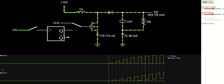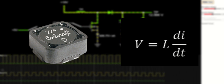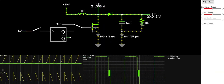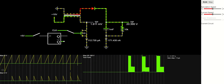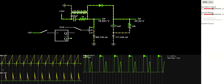This way the magnetic element is uncoupled from the capacitor — or so it may seem. On startup, the inductor current quickly jumps to a very high value, bringing us back to square one. The rate of current rise or fall through the inductor is proportional to the voltage across it. When the capacitor is uncharged, this voltage is basically a diode drop, leading to a very slow current ramp down. You can also think about this in terms of an RL circuit: the lower the resistance, the larger the time constant. Keeping high voltages away from the low voltage side also calls for galvanic isolation, achieved by splitting the inductor into two parts — a transformer — giving us an additional variable: turns ratio.